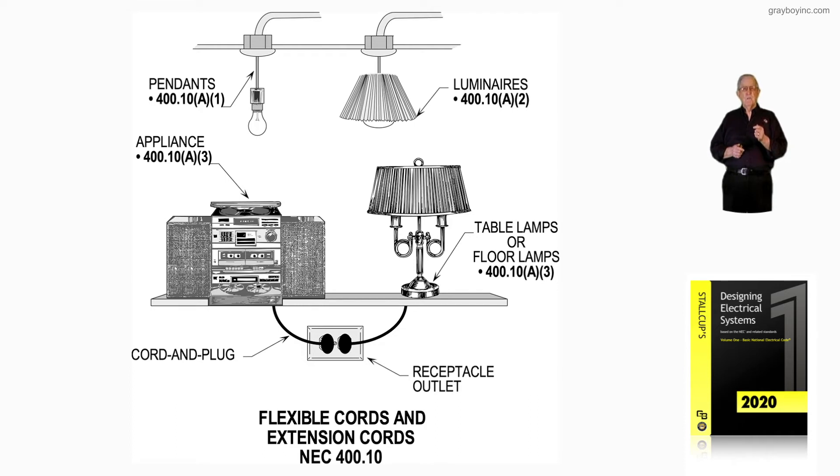400.10 A1 would recognize a pendant type fixture — we called them fixtures back in those days. In a shotgun house or a small square footage area home, sometimes you might not even have but a 120-volt service with six fuses. That pendant could hang down with a pull chain so you could just reach up, turn it on, or turn it off. You had to be very careful, because an old lamp can get hot, so you'd hold it and pull it down so your hand wouldn't touch it, letting it extend just a little bit below the lamp. That would be a pendant hanging down where you'd grab that pull chain.